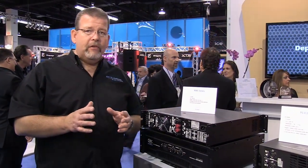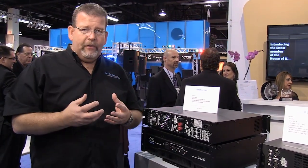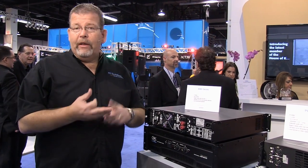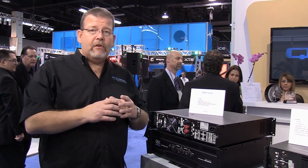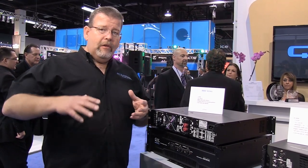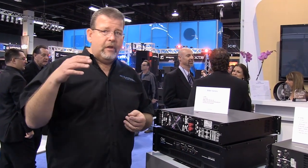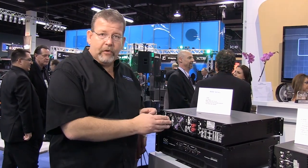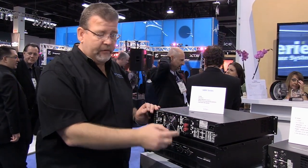The first one we're going to look at is the RMX series. The RMX series have been used for years as a high-powered, robust amplifier, both for touring, for portable sound, and in some installations. The RMX has a large toroidal transformer that's designed to deliver a lot of current, and that current gives you the ability to run the load at two ohms — you can take two or four speakers and combine them together for a two-ohm load, or bridge the two channels together for even more power.